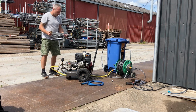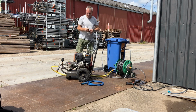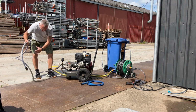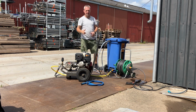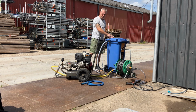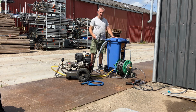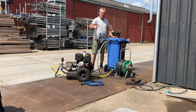The next hose I've got, we then use that piece, stick him in there. He connects up to there, around the back here. Goes back in there. When you let go of the gun, this recirculates, which means it keeps the pump cooler. That will then go back in there to be reused. And if this was full and you let go of the trigger and this was recirculating, this won't overflow because we're just using the same piece of water around in a circle.